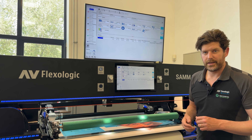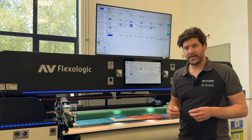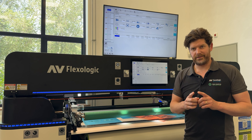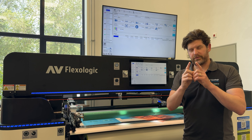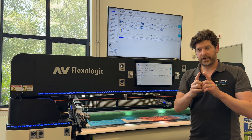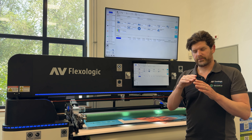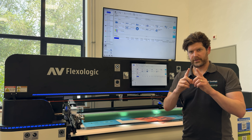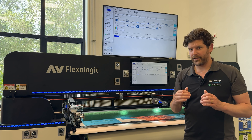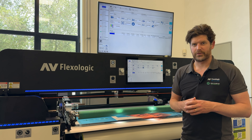What we do recommend is a minimum size of mounting marks at 0.4 millimeters. It's not because we cannot recognize smaller — we can still recognize a 0.25 or 0.3 millimeter micro dot — but it's because of the stability of the dots. Over time, plate wear can cause smaller dots to chip and break. So 0.4 millimeters is our recommendation for stable image recognition results.